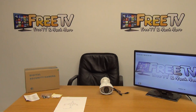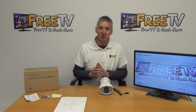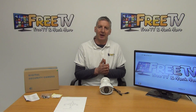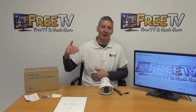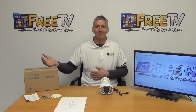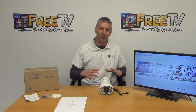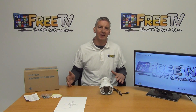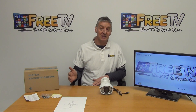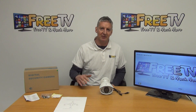It's not a perfect demonstration given we're just in our video room, but the point is that people have been pigeonholed into certain technologies — TVI, AHD, and similar — or a certain standard of camera or DVR, and are finding they're not backward compatible with previous versions. What we've done on the camera front is gone for a 2 megapixel camera that can be set back to 960H to work with traditional lower-spec DVRs, and it will also work across the full range of technologies: analogue, AHD, TVI, and CVI.